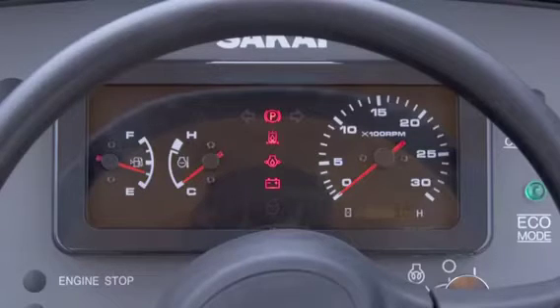You can see a green lamp when vibration is applied and also a green lamp when working lights are switched on. On the right side of the monitor you can find the eco compaction mode lamp. This lamp will go on when you move the throttle lever to the eco compaction mode position.